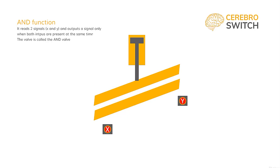We have a simple pneumatic cutter manually fed with parts. Here, a worker has to put in the parts, then press a button for the cutter to actuate, and finally, the worker has to collect all the leftovers. The concern here is about safety. We do not want the worker to press by mistake the command button and actuate the cutter while he is handling the part.